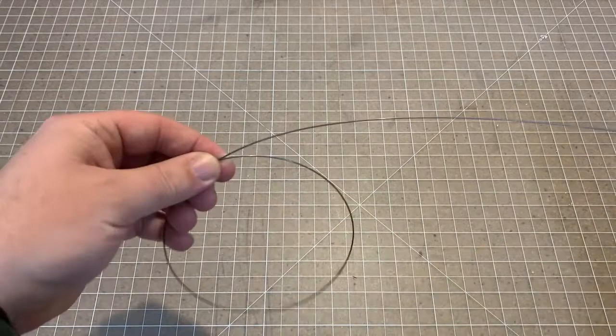So no heat required, no soldering, and no torches. To accomplish that I'm doing it out of 18 gauge copper — it's primarily what I use, it's easy to get hold of — and you're going to need your saw frame, a drill bit, and pliers. The only other crucial thing you'll need is what is commonly referred to as music wire. It's a very thin high carbon tool steel wire that is very flexible and will bounce right back to its original shape. I buy mine at a local jewelry supply place, but I've included an Amazon link in the description. You generally want to use this for its spring quality to create spring-loaded pin backs that will keep their tension so you don't need any form of an actual closing lock to hold the pin in place.